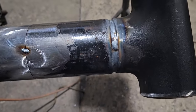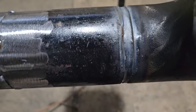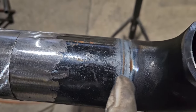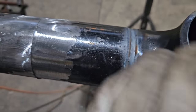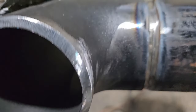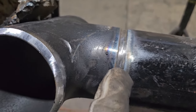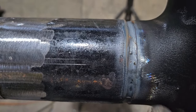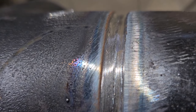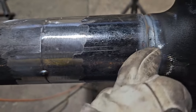Any time you see me do these welds, I grind down my start-stop because those are the only parts that really need touching up. If you can see the sidewall, there's nice fusion on the sides, so I tend not to grind it - only because it's a Class 2 weld. If it's Class 1 or x-ray, that's a different story. This one here has been ground down and you can see how clean the sides are. There's nothing to worry about when it comes to what you're leaving in the weld if you don't grind it.